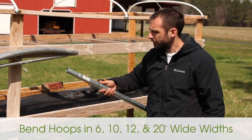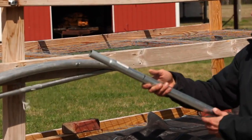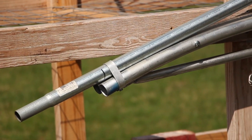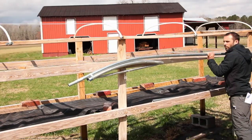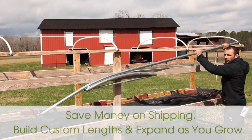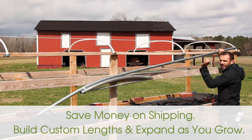This swaged end fits into the bigger ground post. We're going to use our guide line that we made before — nine inches from the end. We treat the other end the same way; we don't want the ends to be too curved because they have to fit into each other and also into the ground posts. Go right up to our line, down about 18 inches. Make sure your pole is straight and you're not bending it side to side.